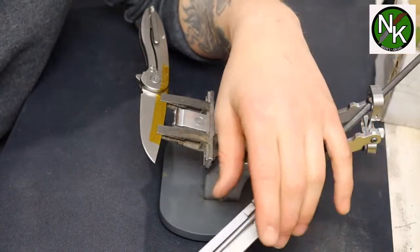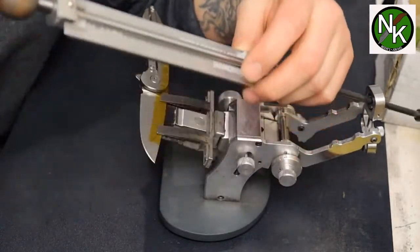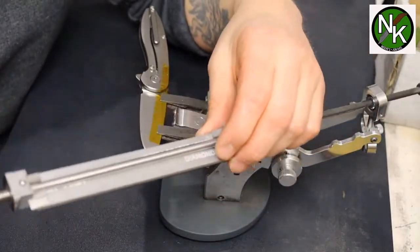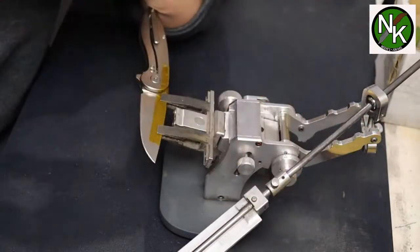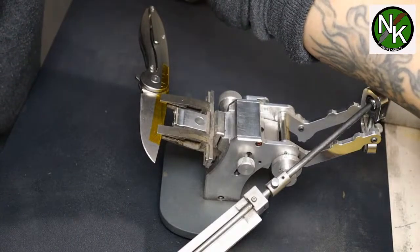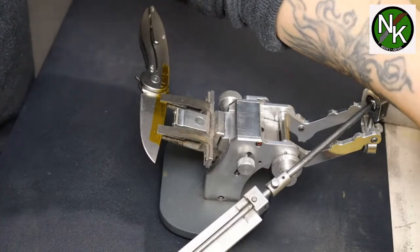But it's not 150 grit. It says F-150 on there, but it's not 150 grit. It's an F rating. F rating is different. That is basically Russia's way of translation of grit, which is completely different than ours. Just like my 2,000, or sorry, my 1,200 grit VENEV is 5,000 grit. That 1,200 is 5,000.